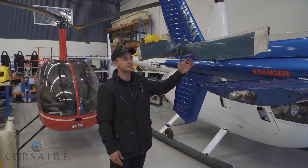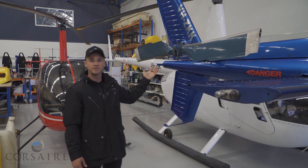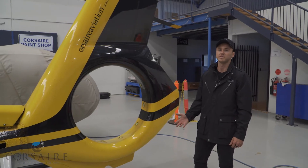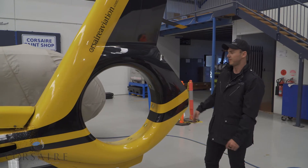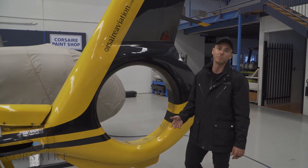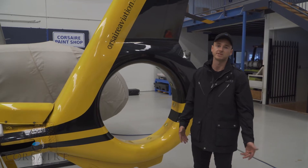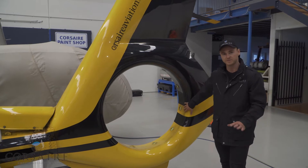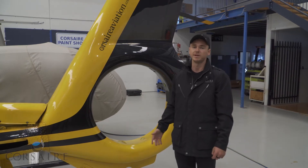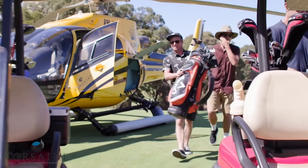Now with a conventional style tail rotor it's able to feather and flap. Both these tail rotor blades are exposed, and this is one of the biggest risks on any helicopter — the tail rotor being at head height. The biggest difference between a conventional tail rotor assembly and a fenestron tail rotor assembly is that our fenestron tail rotor is actually enclosed in our vertical stabiliser. This gives us both operational and safety benefits. As pilots operating in confined areas, the biggest risk is our tail rotor striking an object. With an enclosed fenestron tail rotor it gives us a little more safety buffer in tight spots, and for passengers manoeuvring around the helicopter as a charter aircraft.